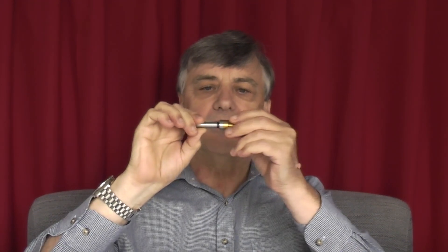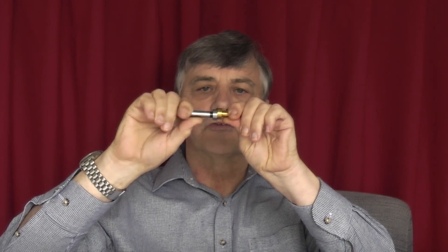Hello, welcome to E-Knots Engineering, I'm Alan. In today's tool review we're looking at this edge finder or centre finder for a milling machine. It's titanium coated, high speed steel and it has a spring down the middle that holds it together. What I want to do today is see how accurate this is, what it will repeat to and whether it can find the centre of a hole. So let's go into the workshop and see how we do it.